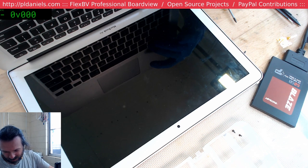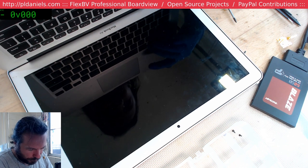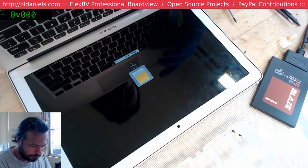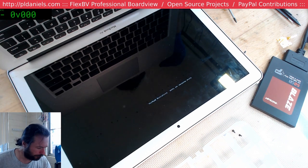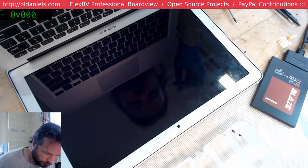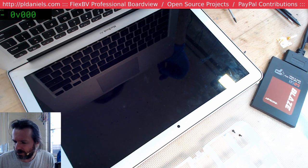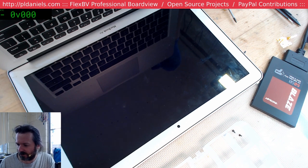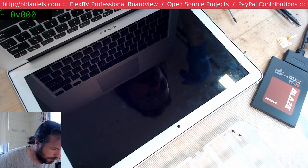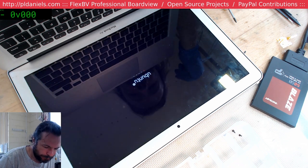Greg, to be honest, I can't remember what it was in for before. I'll have to go back over my list. I really should print out the list. Okay, if I boot... I would be very surprised if it is actually something other than the daughterboard, because the audio chip's on there, so it's got to either be one of the connectors going off to there, or the daughterboard. We'll find out quick enough.